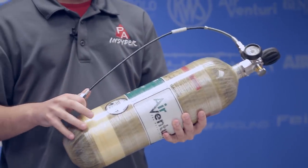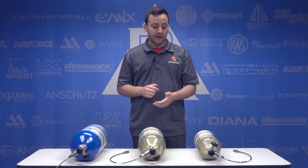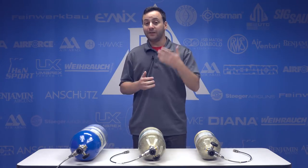MAE stands for Modal Acoustic Emissions testing. Think of it like a seismograph — they strap the tank in, pump air into it, and monitor the sound waves the tank makes at a very high level. Those sound waves tell them a lot. Through their research, they determined that a certain frequency means there is fiber delamination in a specific area of the tank, while another frequency indicates structural damage to the carbon fiber wrap. Things that might be missed on a visual inspection can be caught through MAE testing to determine if the tank is actually safe.